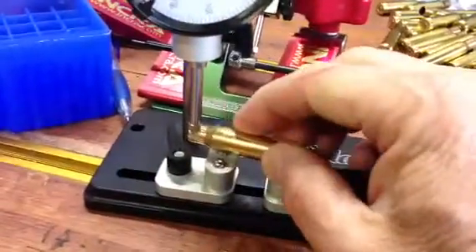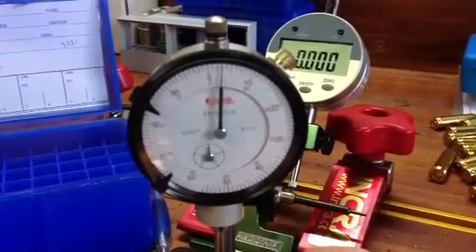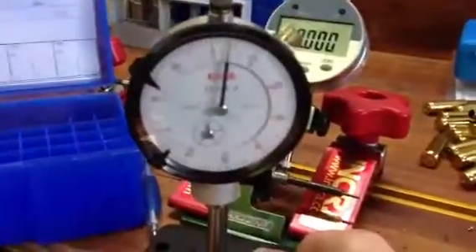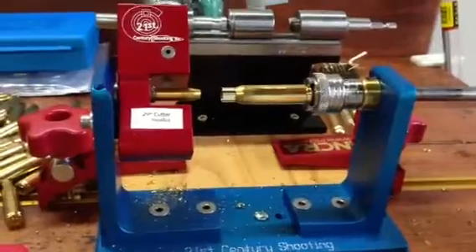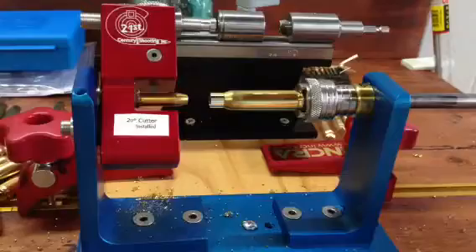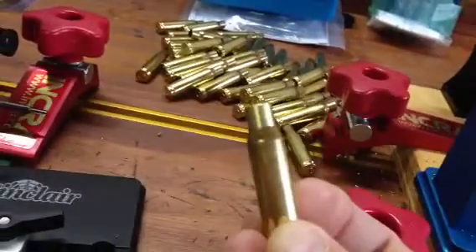I'm having a hard time because I'm not doing it correctly. Typically you'd make sure that you had consistent pressure as you were turning it with two hands. But since I'm trying to give you an idea, with more consistent pressure you can see how steady it is — right down there in the neck. That's amazing. So that's why you want to get this 21st century little lathe. You could neck tune them all the way to a specific chamber, but that's not what we're after. We're after the thickness of the brass along the neck to be exactly the same between case to case in that fired batch. And that's it.